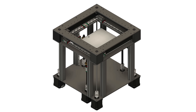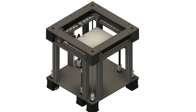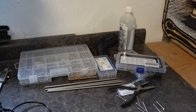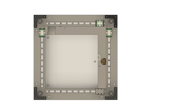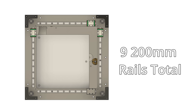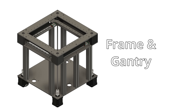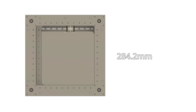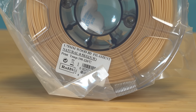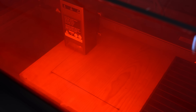As a result, the scope of this video is going to be changing a bit. For the printer itself, I ended up using a concept by DK which was based on Rolo's design rather than using Rolo's directly. The reason was purely because the hardware I had laying around was better suited for DK's cross. DK's cross also uses 200 millimeter rails, which is convenient because I can reuse some rails off the old Rook. We won't get a whole printer, but finishing the gantry is looking doable. All of the laser-cut parts are going to be cut from these 300 millimeter sheets — the parts themselves are a little over 280 millimeters, so I don't have much margin for error. All of the printed parts are going to be printed out of this ESUN wood PLA, just because it goes with the theme.